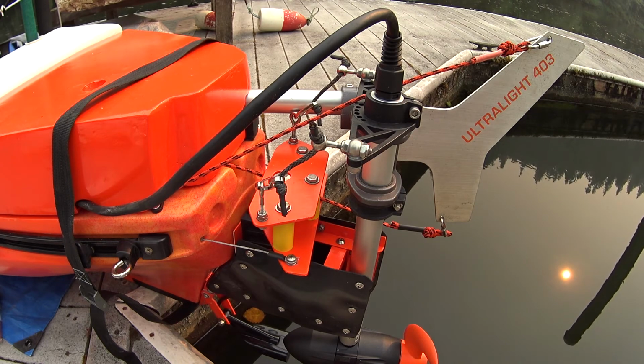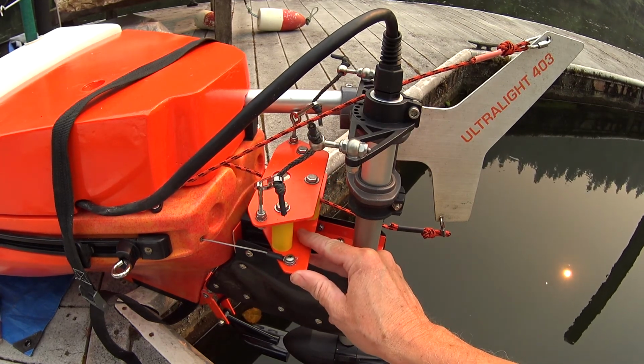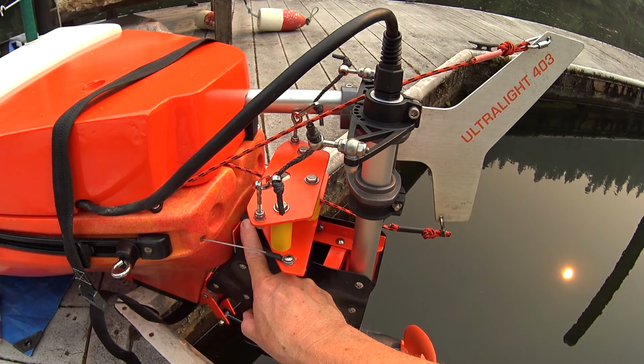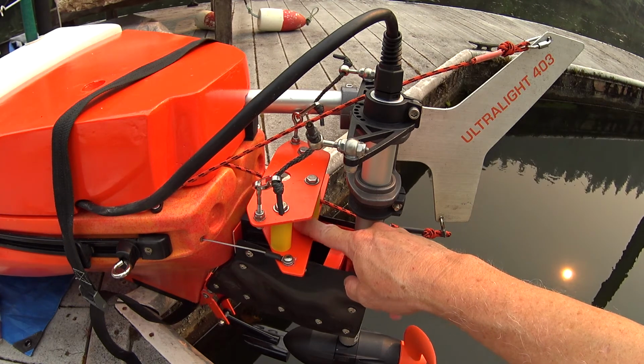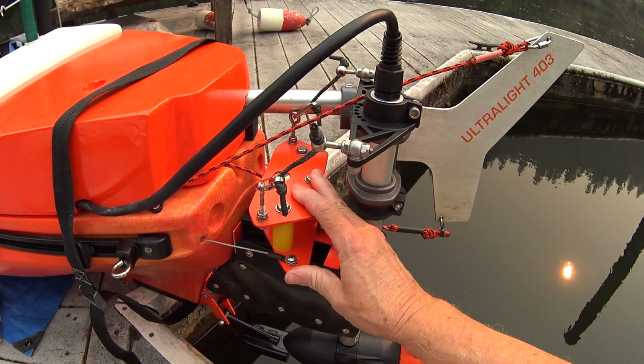But going back to the basics, which I had last year, was to fix the problem of the rudder cables pulling directly on the Torqeedo. I added an intermediate swivel plate, which is this guy right here. It's mounted to the original rudder bracket, which is this black object here, and there's where the rudder axle went through. I've now got a bolt that this plate then pivots on.